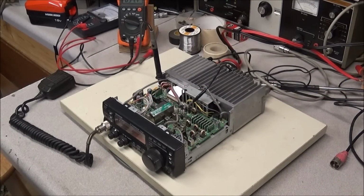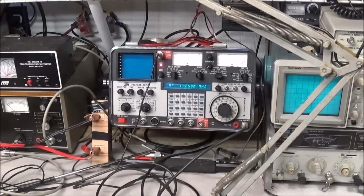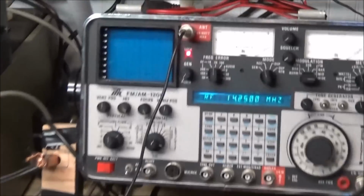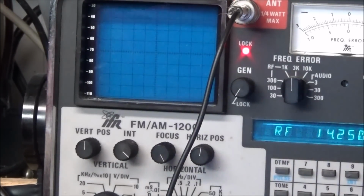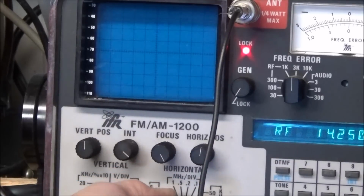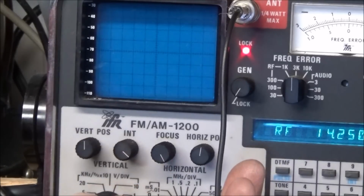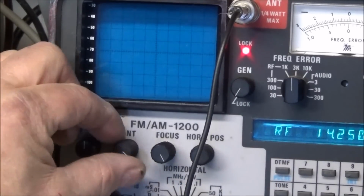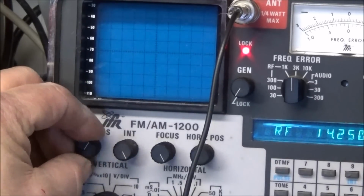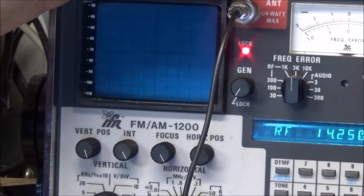Okay, so now it's Saturday morning. Yesterday I was going to perform a few tests, and I went up to the IFR and I set it for spectrum, and as you see, there's no display in spectrum mode, although scope mode is working, but spectrum has completely gone. If I turn it over to very minimum intensity up, turn the vertical up, I can barely see a little flash in there. It's hard to see with the light on it.